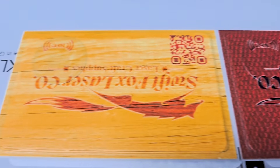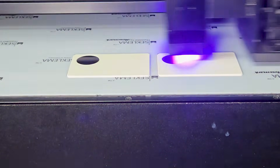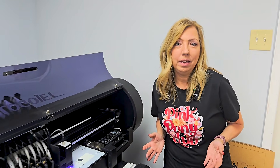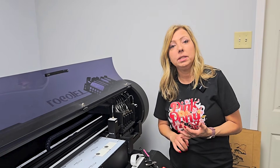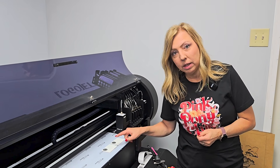This is our first test run — you can still see the NFC tag. So we tried a different approach: six layers of braille, which builds texture in UV printing. But six layers was way too many — one layer of braille equals four layers of white, so it ended up being way too thick. We tried two layers of braille, then finally figured it out: four layers of braille puts us at 0.28mm, and the tag is 0.27mm. So now we add our color on top — three layers of white, one layer of color, and a layer of clear.